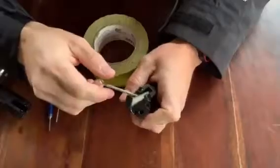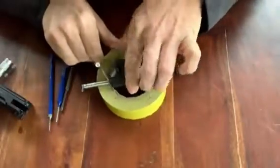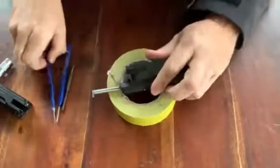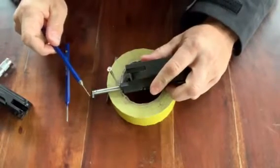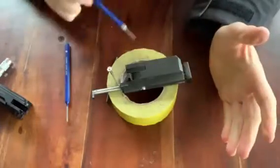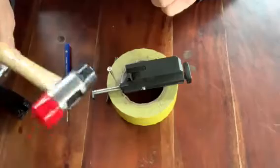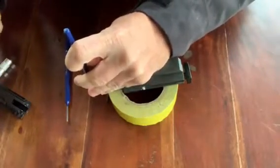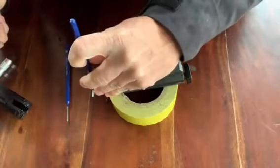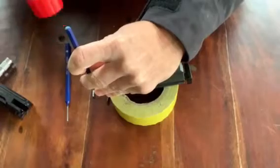You can use this or you can use your paper clip. Let's go ahead and position it right there on the roll of tape. There is a roll pin right here that needs to come out in order to remove this and subsequently the entire assembly. I'm also going to be using my handy-dandy striking device. Let's go ahead and drive that one out.